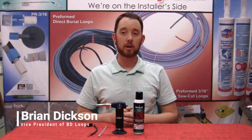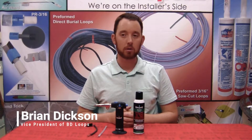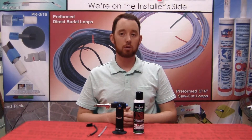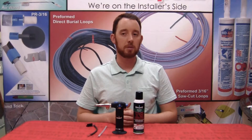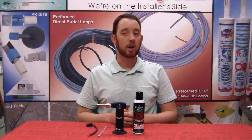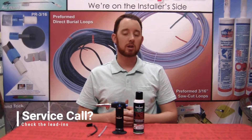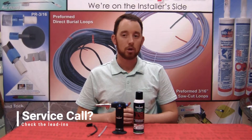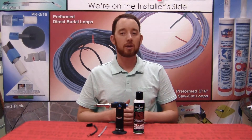So what we learned today in this loop talk is how important it is to tin or solder electrical loop connections. If the connection becomes loose, oxidizes, or corrodes, the loop circuit will not be completed, which will cause the gate to be held open or prevent your system from working properly. When on a service call troubleshooting a loop system, one of the first things you should do is check to see if the loop lead ends are tinned or soldered. You'll be surprised at how often this simple exercise will fix the problem.